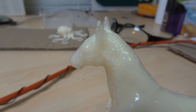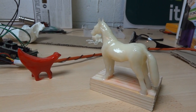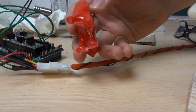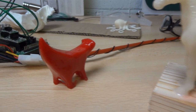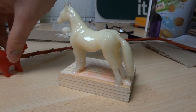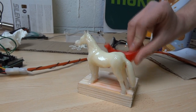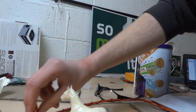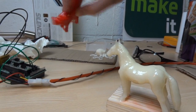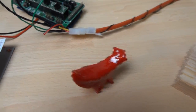It might do it while the remaining acetone evaporates away. We've been told that it continues to work after you take them out for a while. With the lid, we found that it's good for getting the vapour cloud up, but if you leave it on, the acetone tends to boil on the parts and leave bubbles — like these holes in the top of my part. Don't use wood — it's just stupid. Capillary action wicks the acetone up and melts the feet, and it's hard to get them off. Use separate stands for pieces you want to take out separately, because we had to cut mine off the wood and it's done a bit of damage. It would be better to leave it on as it's setting. Put extra top solid layers on, because this hole actually goes through to the interior of the part and it just started growing. So that was acetone vapour smoothing of 3D printed parts, from So Make It.